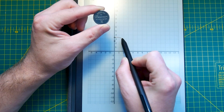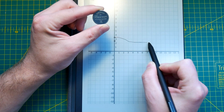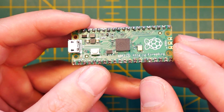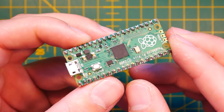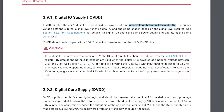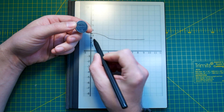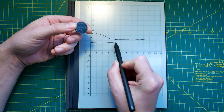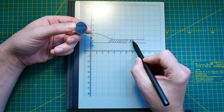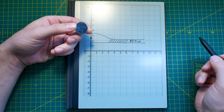So when the battery is in use, the curve of the battery voltage would look something like that. It wasn't until recently when I was going through the datasheet of the Raspberry Pi Pico — those are really nice microcontrollers with one very unique behavior that separates them from the likes of ESP or Arduinos. They're capable of creating a voltage reference from as little as 1.8V, which means you will have a 3.3V ADC reference to play with, which is brilliant for my use case because those batteries are 3.3V at start and they only go down from there. So I can take advantage of this and actually power my Raspberry Pi Pico with, well, dead batteries.